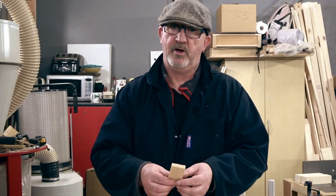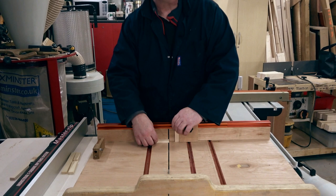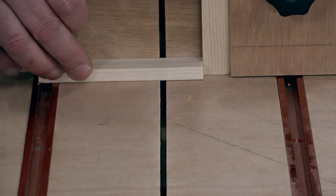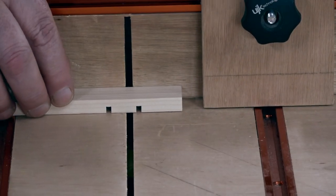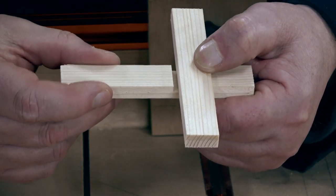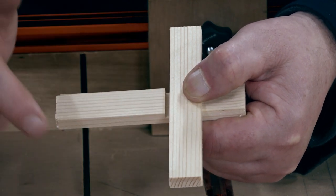The best thing to do is to probably show you what happens if you don't use a kerf maker. I'll try and make a cut into a piece of wood here and try and make a groove to fit two pieces together like a half lap. We'll do that without the kerf maker and see what happens — take a cut and then put that thickness up against the stop. So I hope you can see that by using the stop method, your half lap joint is too loose, and that gap is exactly the same as the thickness of your blade.